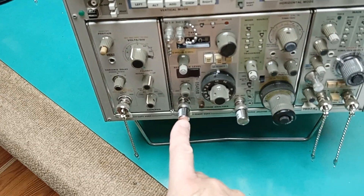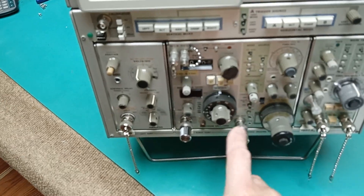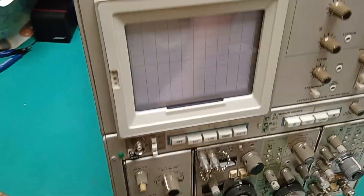Warning on the spectrum analyzer and TDR: keep the ports terminated. Those are 50-ohm terminations. Do not leave them open — that might be the end of the unit.